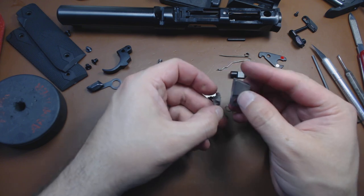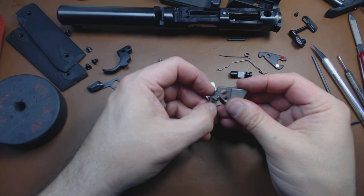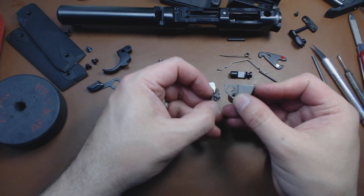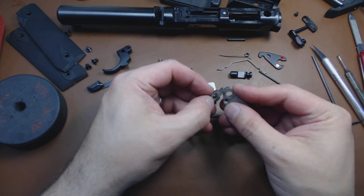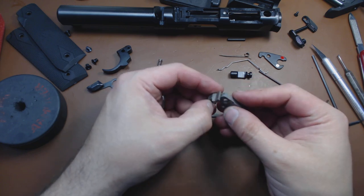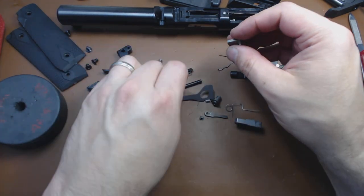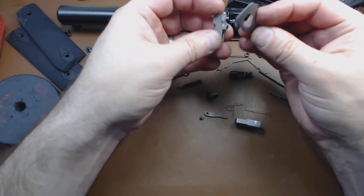And then the sear has, you know, a spring on it that's going to push it back into place, and so as soon as the gun is cocked past that point, it snaps back into that notch and catches the hammer again. So that's the whole sear engagement area. It's relatively small, it's very clean, gives you a nice crisp break. But the sear's got a whole lot of meat to it anyway, for other reasons. Where it engages